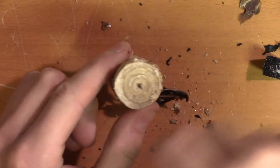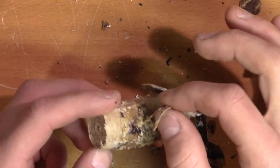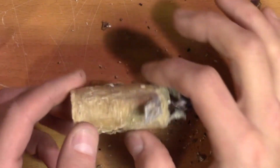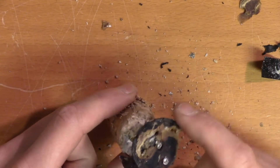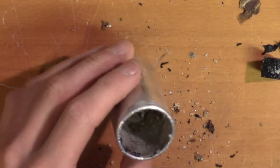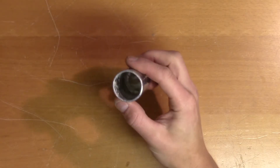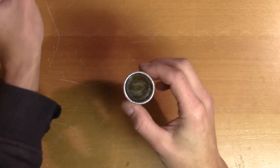Here you can see obvious signs of how it was wound. This is the piece of foil that attaches to the casing. This part where the terminal attaches is probably Bakelite — at least it smells like it. The plan now is to clean this out and put the new electrolytic capacitors inside it. It is wax, so it should be possible to melt it. Let's try that.